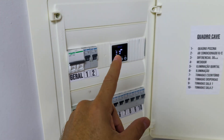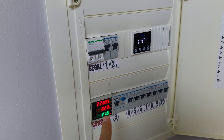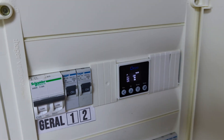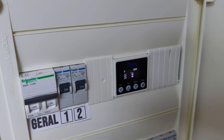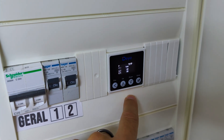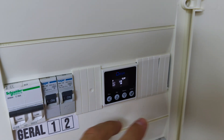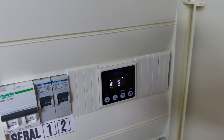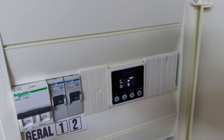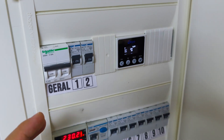I've done a lot of tests over several days and already shared them with you. Right now we can see on this CT — which is not a smart CT, it's a dumb CT, but it works nicely — and this optional one here, which I believe is awesome if you're getting one of these Deye systems. It's communicating wirelessly with the inverter at a distance, sending the information. So if I'm producing 900 watt-hours on that grid inverter and the office is using about 500 watts, that means I have 400 watts of surplus power that the Deye picks up from the wireless CT and sends to the battery.